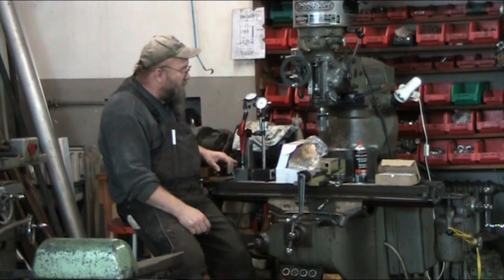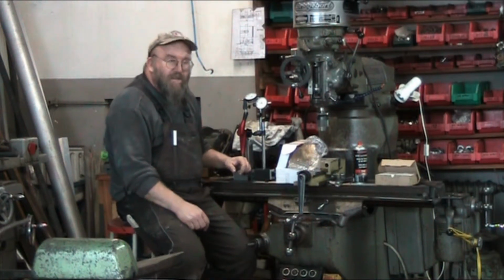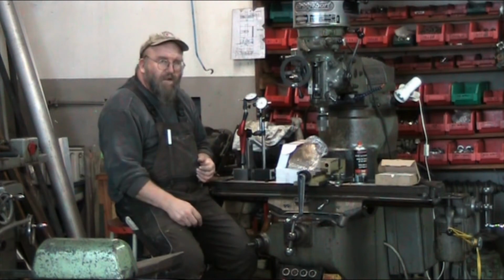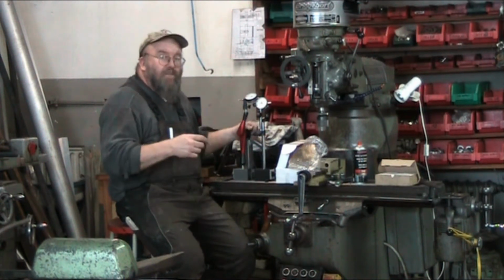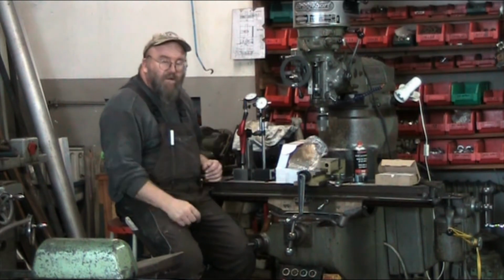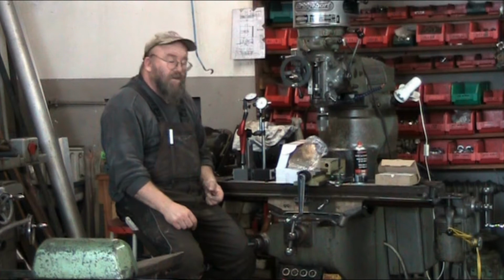Now this Fisso is like the articulated Noga magbases. The only difference is it's a little bit cheaper. Not much, but a little bit. It operates on a hydraulic principle as well. When you release the thing and tighten it up, there's a hydraulic piston or something in there that forces out fluid and arrests motion of the articulated arm.